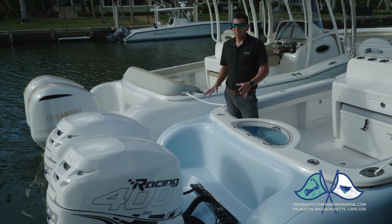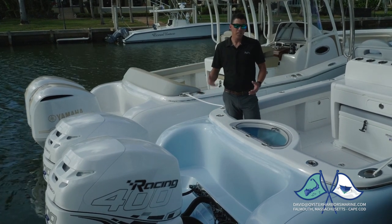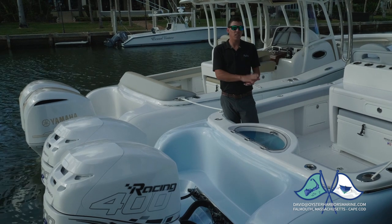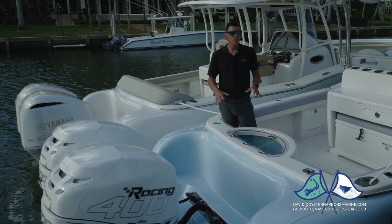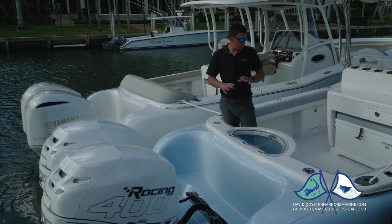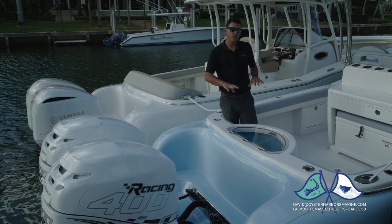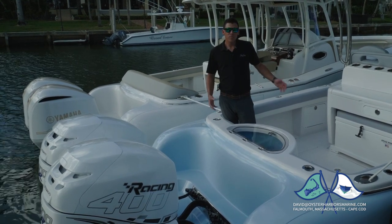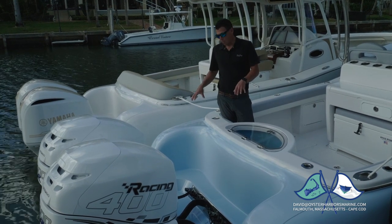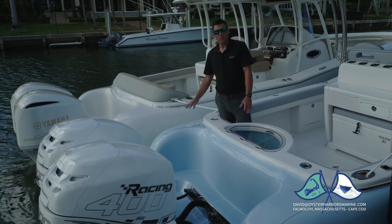Everything is sealed — it's an extremely strong constructed boat. When we build this boat to get this shape, we do it a little bit differently. When we lay up the hull, we also lay up a molded stringer grid at the same time. That stringer grid is put in the hull corresponding on the last day of layup, so we actually pull the hull from the stringer grid. By doing this, everything is straight — there's no chance for any deflection or movement. We go back in and do secondary bonding on every major surface in the boat. Once we set the liner in, before the deck goes on, we actually bond the sides of the liners to the hull. It's an added step that seals everything off and makes it extremely clean. We have access back here to bond that liner into the stringer grid into the hull. And then finally, we put the deck on the boat. We fiberglass both inside and outside in this transom area and finish it off to this mirror gel coat.